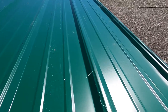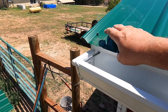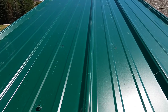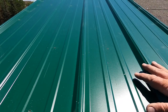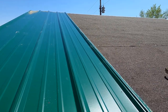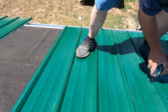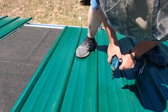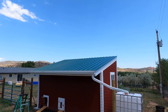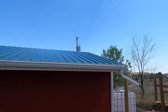When you first put on these metal roofs, get your first piece on and get it squared. I'm an inch and a quarter down off the edge of the roof here and flush up front — everything is where it needs to be. So I will screw down this piece, and as long as this is square, your whole roof will go on square from this point over. I've got the metal roof on and now I don't have to worry about hailstorms damaging it too badly.